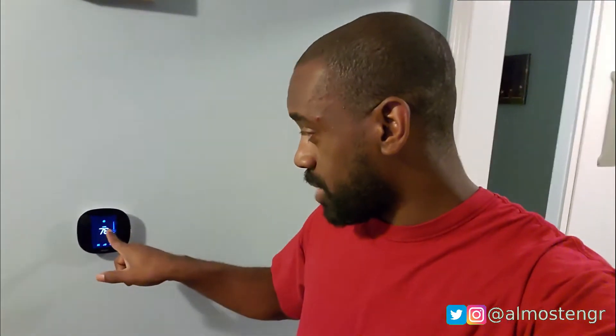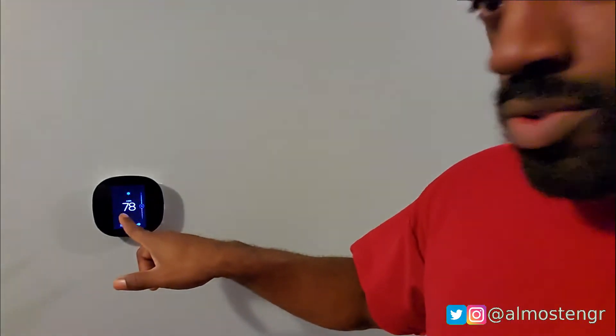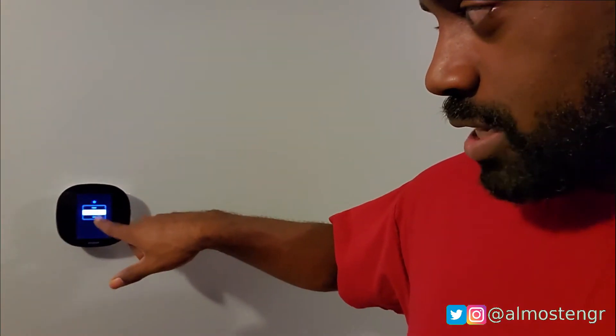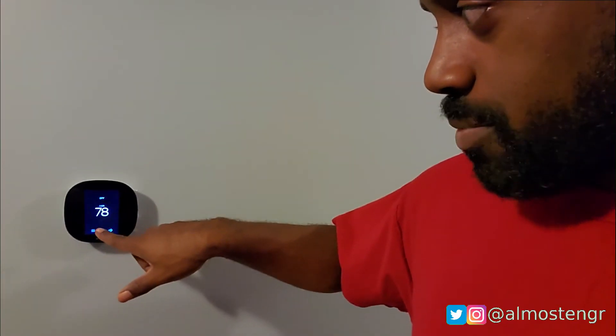The first thing you have to do is shut off the power. Right now the HVAC is running so I'm going to switch it off. You tap the screen and up here at the top there's an icon for heat, cool, and off. You just tap off and as you see the system is now off. I'm going to let the blower continue to blow until it shuts off on its own because my system has a fan controller built into it, so the fan is not governed by the thermostat. I'll let that finish and then we'll go over to the air handler.